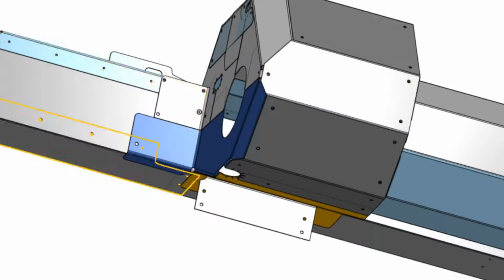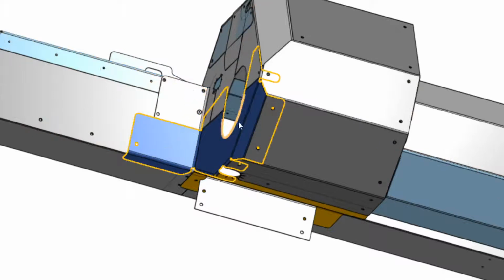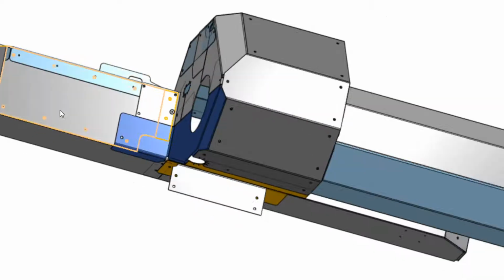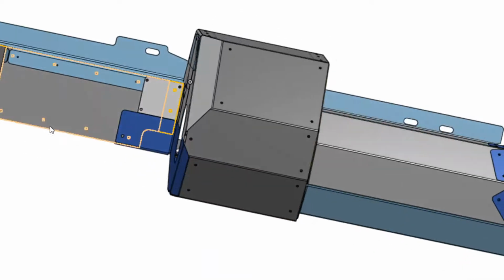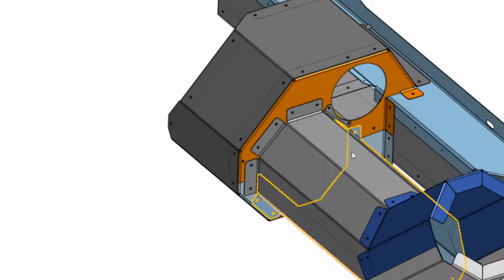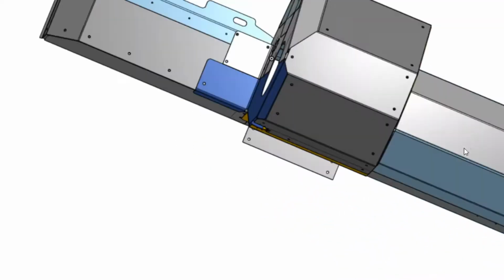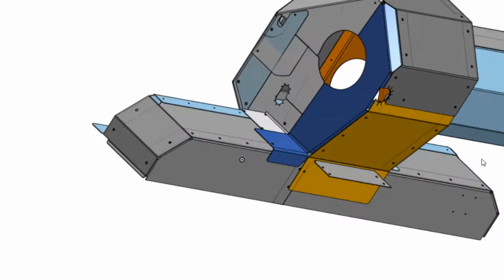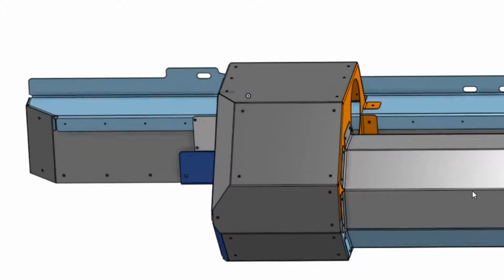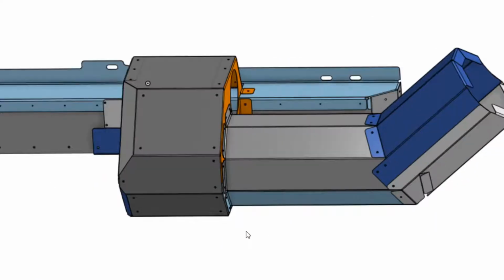And I'm not sure if you can get every one of these, because the air line entering the turbo compressor actually is in here, and it really kind of blocks some of that area or makes it tight, but you may be able to get all of those in. A little easier to get them in on the other side, but you'd have to reach underneath and get to some of these as well. So those are the first few pieces that cover the manifold, and that will be the same whether it's an early 8010 or a late 8010 or even an 8120.